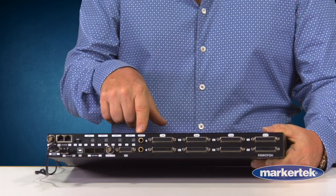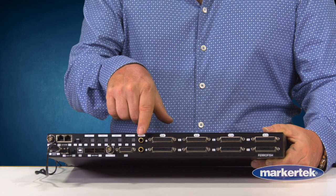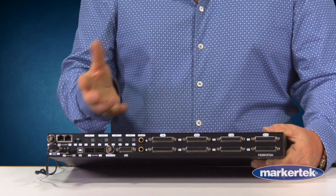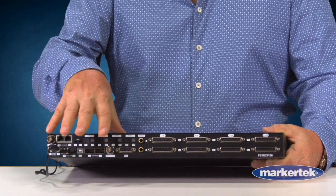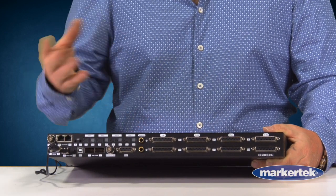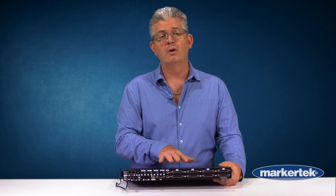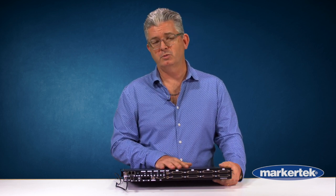New on the A32 Pro version of this product, which is the one I'm holding, is separate analog in and out. So you have left and right outputs that are different than using the D-subs. That's convenient because if you put this in a studio, you might not want to dedicate your D-sub cabling for just a pair of studio monitors. So using this in tandem with an RME DigiFace USB, MadiFace USB, or DigiFace Dante makes this super convenient — not only are you adding analog IOs to your studio, but you have separate outputs for your monitors.